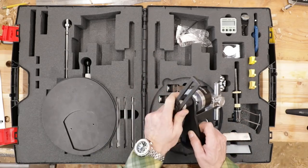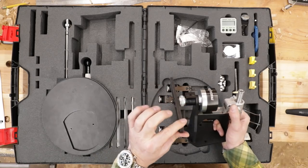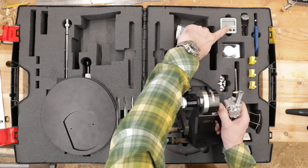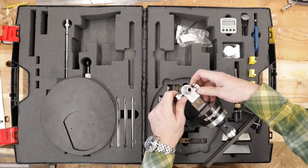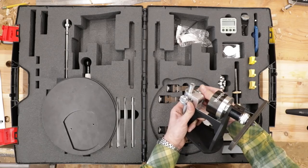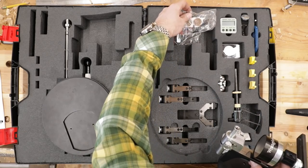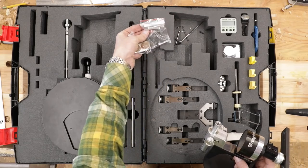I just love the detent. I realized the detent on the original seemed a little too soft — not enough pressure to hold — but simply by screwing this, you can adjust it. I should have known that; I was so excited to use it that I didn't try it. Here there's a machined flat surface to use the angle cube, which I think is the most helpful piece of the whole deal. This adjuster is where you adjust your height. They have machined this with a series of teeth so you can turn this dial up and down. The old one you had to loosen a set screw — this one you can really dial that in very quickly and then lock it down.